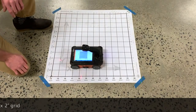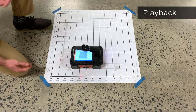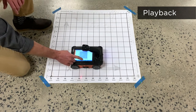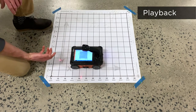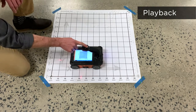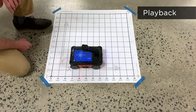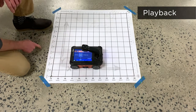Once the entire 3D grid is collected, we can play back and review the data if we'd like. If you believe you may have missed a line, you can always use the Next Line or Previous Line options to collect data over that profile again. Assuming all of your files are fine, select Close Grid at the bottom of the screen and press Enter to exit. We'll then go back to the Main Menu and then over to Playback Setup in the Scan 3D submenu.